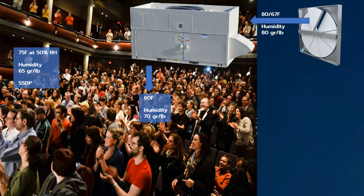This is trying to show you that just because you have a heat wheel or energy recovery device on your air conditioning equipment, it does not mean you're protected as far as humidity goes in the space. You could take this further — at 60 degrees, if the unit cycled off, you'd just be dumping hot and humid air into the space. The solution is to have some sort of active humidity control, like a hot gas reheat.